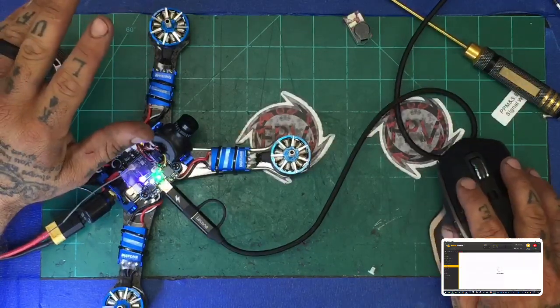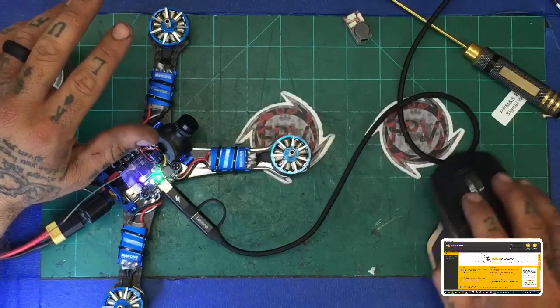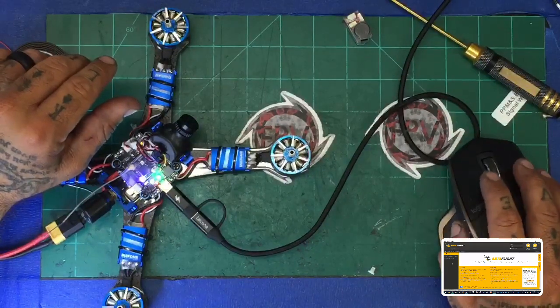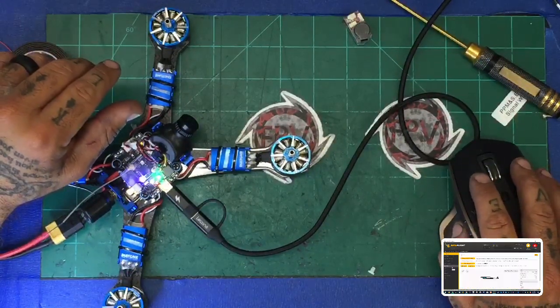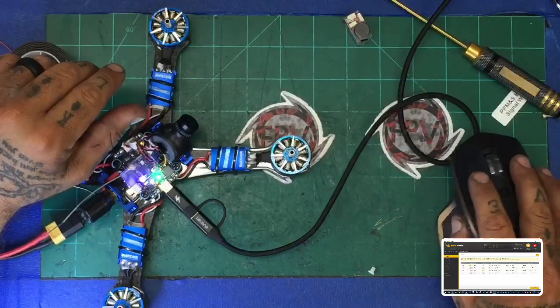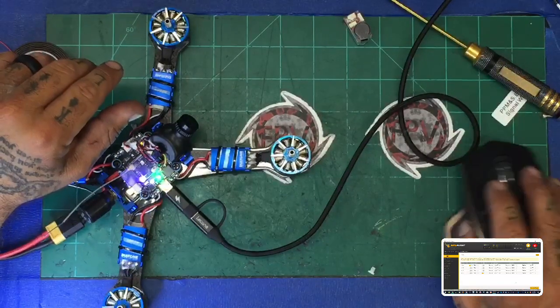Come on. This drives me crazy. Hold on. And I'll put some notes on this for what the setting should be. It'll be posted on the forum, but let me just go and see where we're at and make sure it even took. So ports, UART2 is not getting me anything, so let me go to UART3. We should be in SBUS.